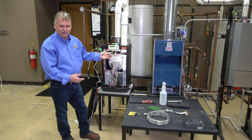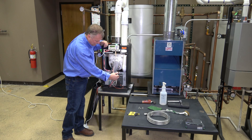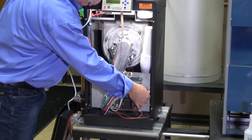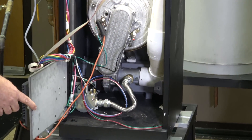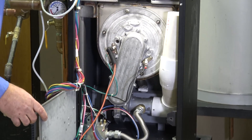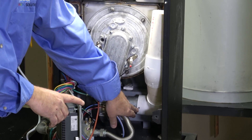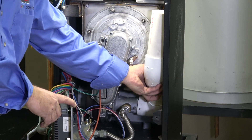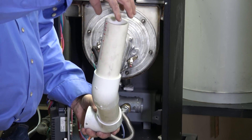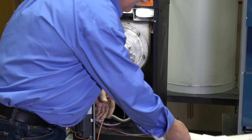For demonstration purposes, we did hide a light in here, so it's not going to be this bright. What you'll find first is the door — the door has the control board itself, all the safeties, all the different wiring. Everything comes right to here. Simple thumb screw opens it up and gets it out of our way. Next thing you want to do is take your Allen key and basically take off the intake tubing. What this does is funnel the intake air in to get a good swirl pattern going before it gets into the blower.